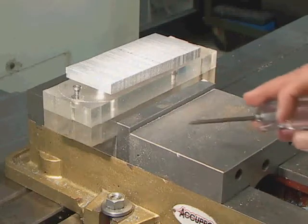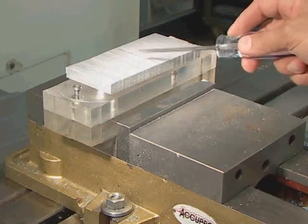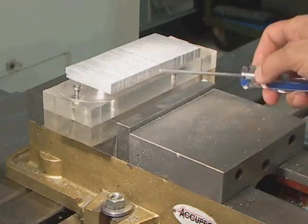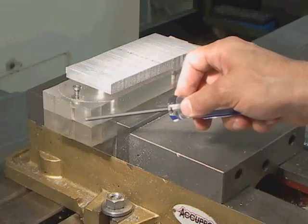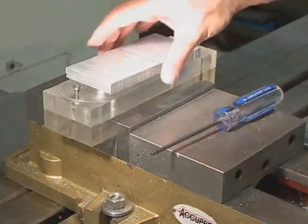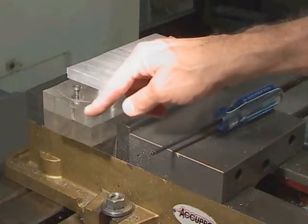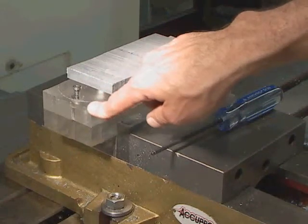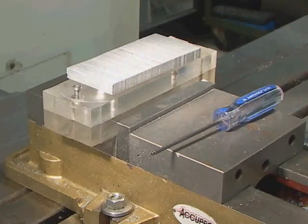The reason we made the jig this way is as follows: after you make your nameplate, a classmate will want to make theirs. We will determine from one specific corner of the jig our XY zero of the CNC machine, and everything will be referenced from that same corner. Therefore, when we take out your nameplate and replace it with someone else's, we will not have changed our XY zero, and we won't have to go through the time-consuming task of re-establishing the corner every single time we change plates. That's the philosophy of this jig.